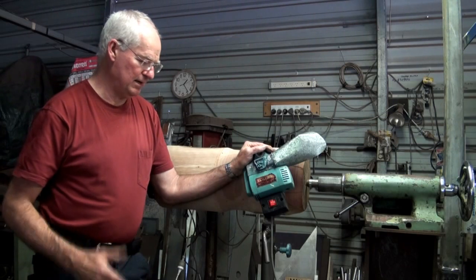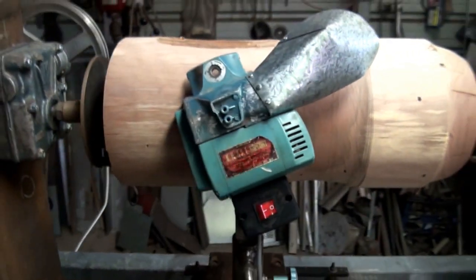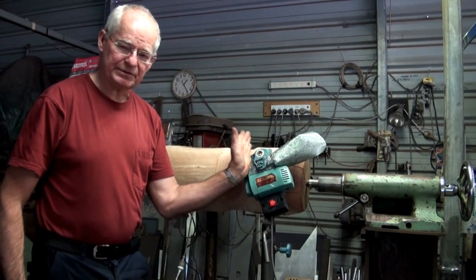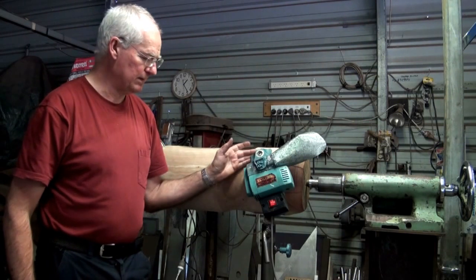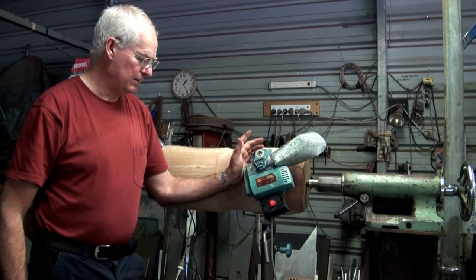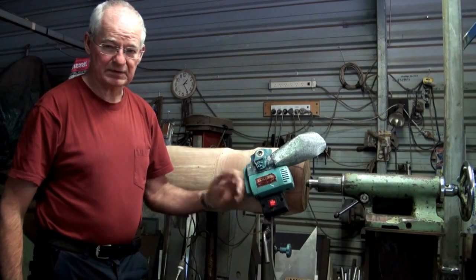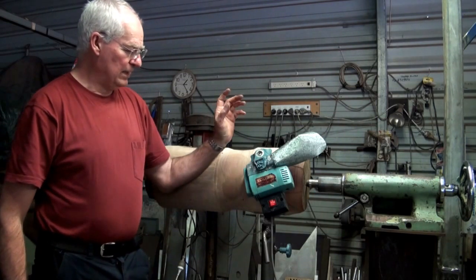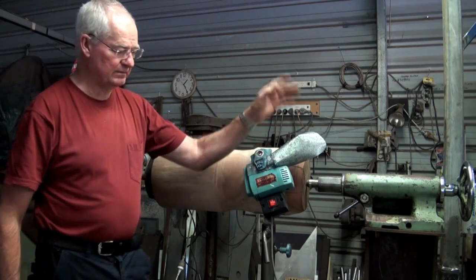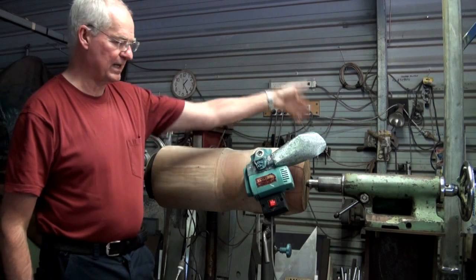The planer head we've used here is just a standard electric planer — this one's actually quite old, it was in my tool cupboard and I decided to update it with a new one. The reason for the angle is to give us a shearing cut, so the planer head is not cutting across the full length of the tungsten carbide tip blades. The handle was removed and I 3D printed a little switch case at the back with a standard rocker switch to start and stop the planer head. Because of the positioning and the angle, we realised the chute was going to direct all of the waste shavings directly at the operator, so this little sheet metal deflector is simply to throw the shavings over the back of the lathe.